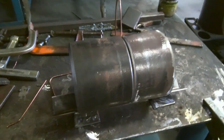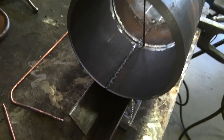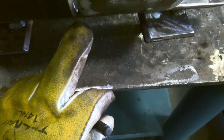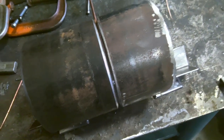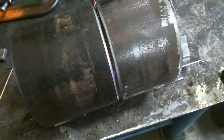This is the method that I prefer. We got a piece of angle iron welded to some tabs down here — nothing too elaborate. It keeps the pieces of coupons on the same plane with each other. You can see in the middle, I kind of line the seams up — they'll hold themselves still. Put your filler rod in the middle there; that gives you the space, the gap you need. I like to tack down here closest to me first. Then I'll pull my wire out, rotate the pipe, and tack again. On a six inch pipe, I normally tack three times, starting on the fourth quadrant. If you divide a piece of pipe into four sections looking from the end — 12, 3, 6, and 9.